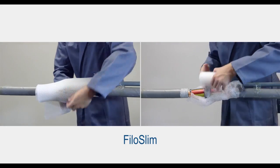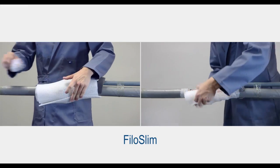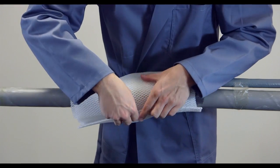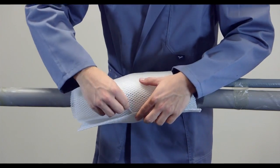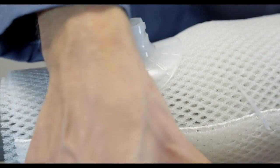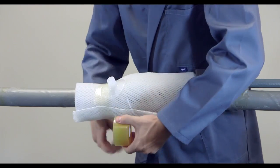This reduces the number of cable joint failures caused when too little gauze is wrapped around too few critical points, such as a ring clamp. The injection valve is taped onto the cable joint and a special closure prevents the injected resin from flowing back.